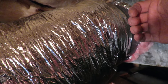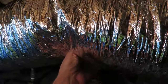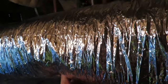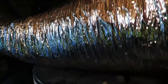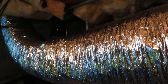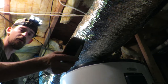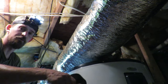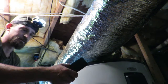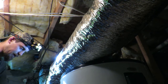This end is completely connected - it's got a zip tie in the middle holding the flexible pipe on, and we've got this end taped and everything sealed up nice. The air will flow right into the plastic flexible ductwork, and the insulation around it keeps the air cold as it continues through the line. For support, we have this ductwork webbing picked up at Lowe's - it's readily available. I'm going to be attaching it using a stapler, very simple, just two staples per side to keep it up in the air.